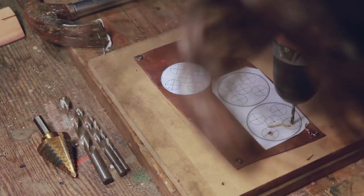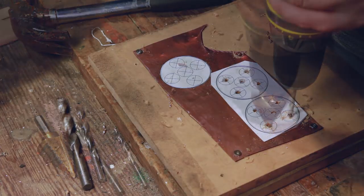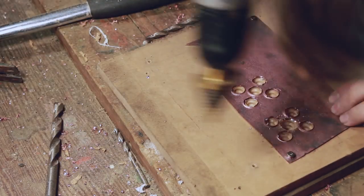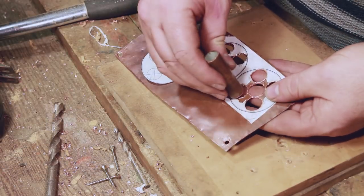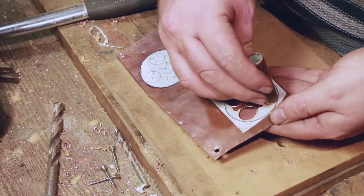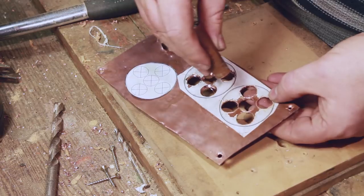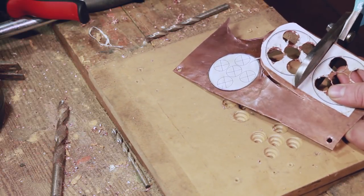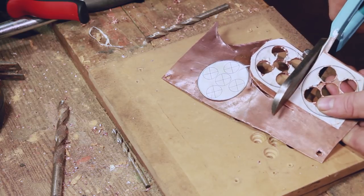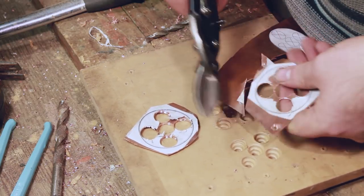In my mind one of the hardest parts of this was probably going to be cutting out and drilling the plates, so I wanted to do that first and secure it down nice so things weren't moving while I was working on them. I worked my way up through a couple of smaller drill bits and then on to the Christmas tree bit, at which point I realized that the Christmas tree bit and the copper didn't match in size properly — I'm guessing that's because it was metric copper and an imperial bit. In any case I had a bit of a tough time — I had to come at it from both sides and try and go halfway between two of the sizes on the bit. But in the end I got a close enough result. It was a little bit touch and go — a couple of the gaps literally had a millimetre of copper holding it together, but it worked.